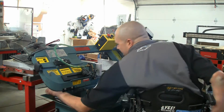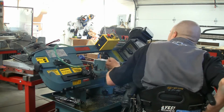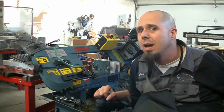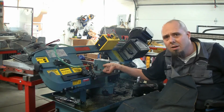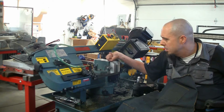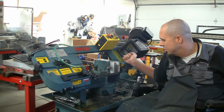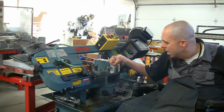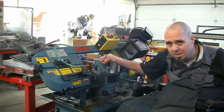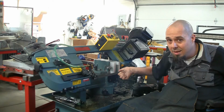So this has a weird release. The vise moves freely, which I thought was broken when I first got it. But that's actually a feature, which is really nice for opening and closing the jaws. Can't really tell well on the camera, but I just threaded 2 holes in the plate. And this plate, I only did one on this side because it doesn't have anything pulling on it, so it was just easier to install with one. That way if I need to remove it, I can. Then I just did a couple little steel toe clamps that I made for it, and it just clamps around the existing vise jaw. So I didn't actually have to modify the saw at all to do these, and I run that right beside the saw blade.